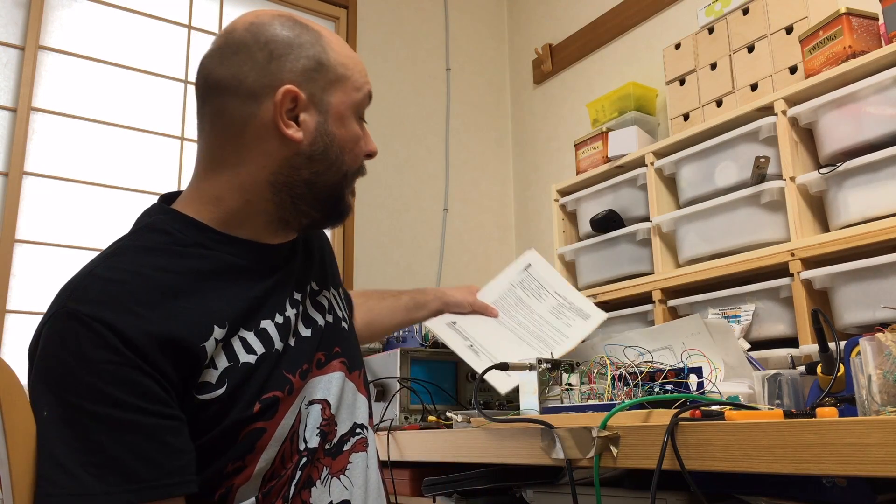These are just my two cents. I think I might do another video where I actually let you hear the differences between the different op-amps inside the Red Crown, and maybe you can judge for yourself. Sometimes the differences are pretty small, but when you're really pushing the input of your operational amplifier, you will find the distortion differs between different op-amps, and sometimes it can make or break the pedal. It's not frequency response we are after — it's the quality of distortion, and that's something that's not easily quantifiable. Thank you for listening, and see you next time. Bye-bye!